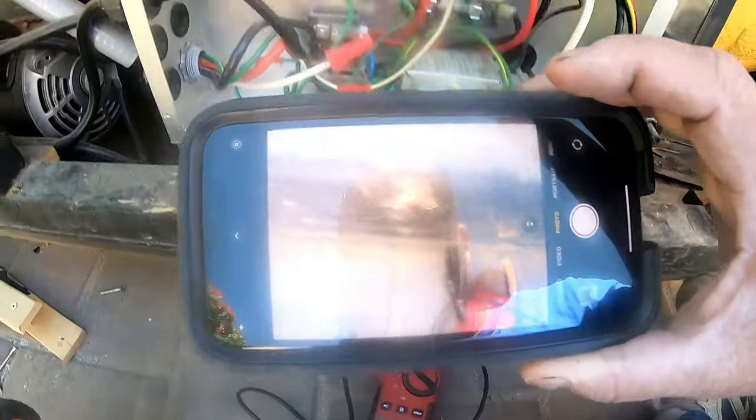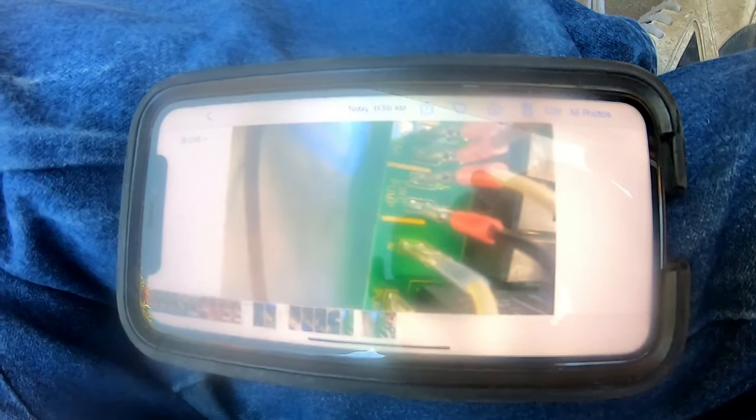Here's where you're going to get out your cell phone and take a picture — let me show you why. You've got different color wires. Right on the board it says 'circulation pump,' so it's not that hard to find. You're going to put your phone on camera and take a picture so that you know which wire is which. That way you can go back and remember — the black one's on the bottom, the white one's on the top. Huge pro tip: cell phone cameras are the best thing that happened for spa technicians and homeowners doing it themselves. When you're pulling these out, take your time, wiggle them back and forth, and then pull them out. No gorilla hands — that will break the board.